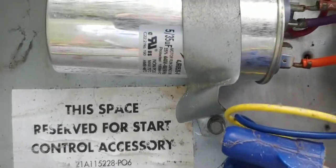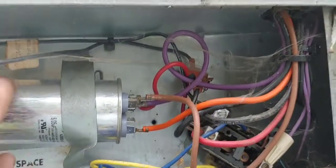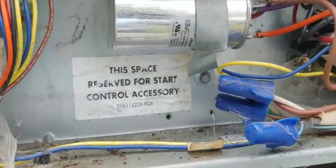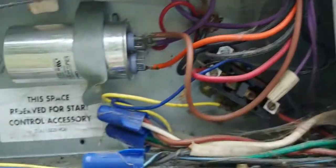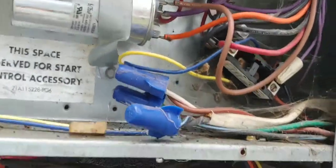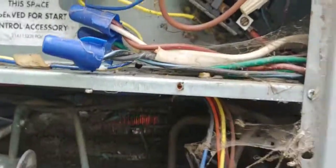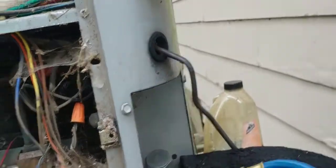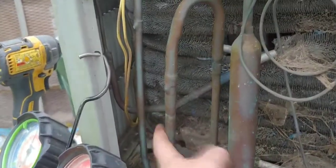So we got a new 35.5. I had to bend it because it's smaller, but I didn't want to put it down where the other one was and bend the heck out of it. We got it snug, we got a new capacitor. And that check valve in there — y'all can hear it rattling — that's all about to break loose and get sucked through the system, probably going to clog things up here soon.